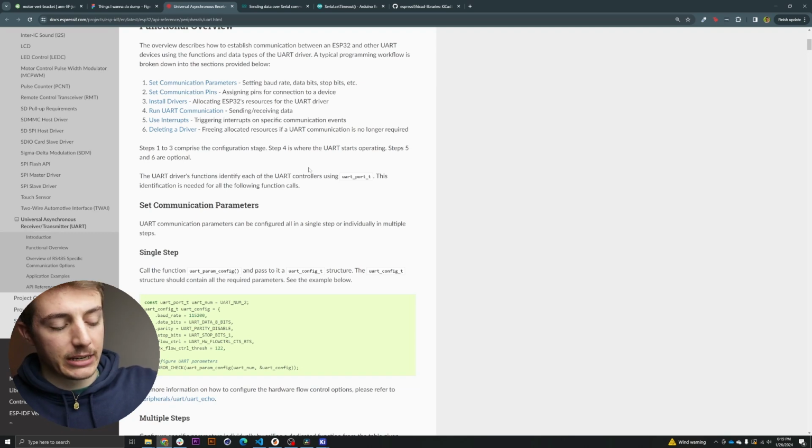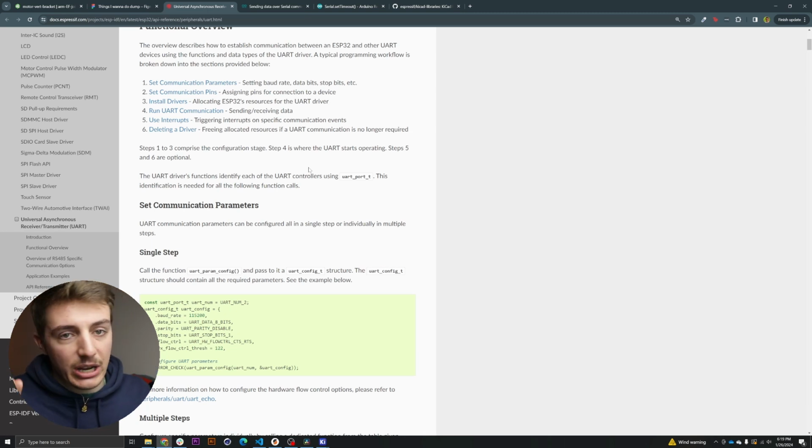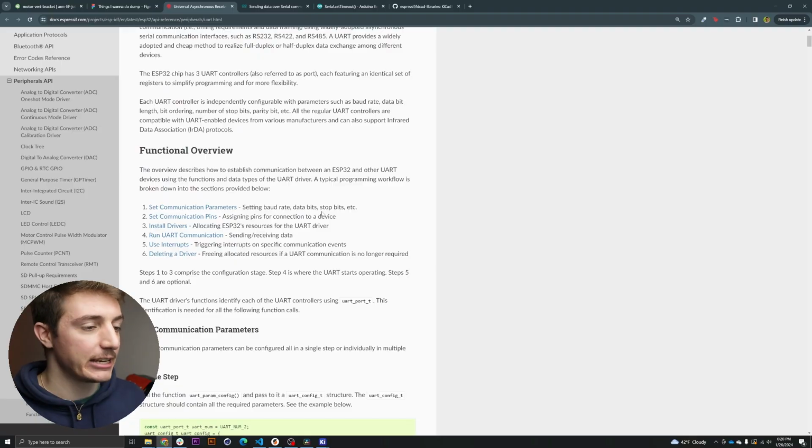And so before going into how that works specifically on this board, I thought to myself that the problem was that the data that the ESP32 receives just takes a little bit of time to be processed. Those are little characters that take some amount of bytes to be sent, and those bytes, sent bit by bit, need to be interpreted and sent back again to the ESP32 as a string. This is all logic and it obviously takes time. And while reading this, I learned about baud rate, which is the number of bits you can send per second. And it shouldn't take that long. It's less than a millisecond to send one of my lines.